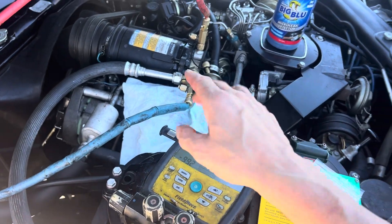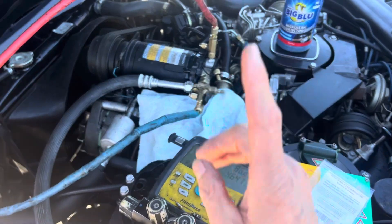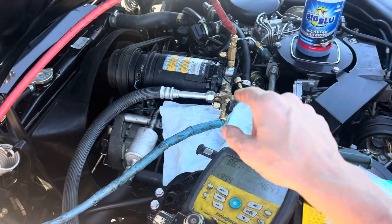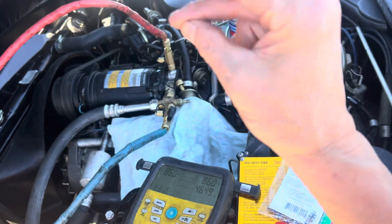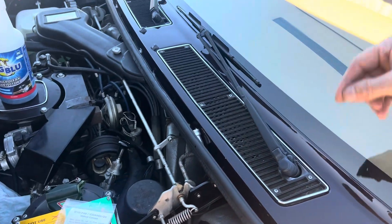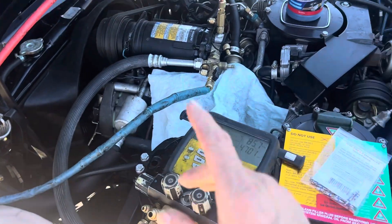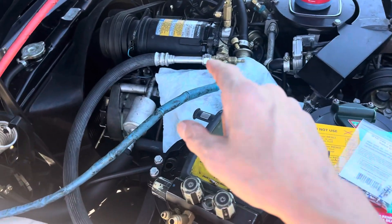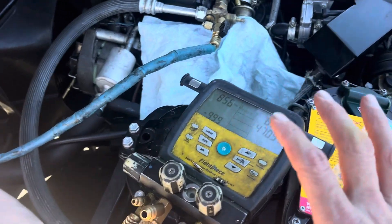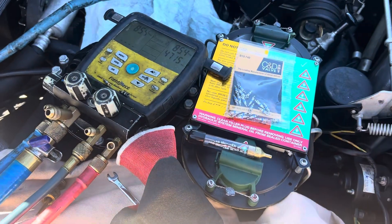Because I put in extra time, I found a leak I probably would not have found otherwise. Now, given that the leak is there, I still don't know if the rest of the system works. The leak is pretty small, and I think once I pump high pressure in and get it working, that leak might seal off enough that I can test the system — find out if the expansion valve is still good, all the ducts still work, the compressor is mechanically good. So I'm going to put refrigerant into the system and test the rest of it. Right now I just have dry nitrogen. I'm going to change these valve cores anyway.